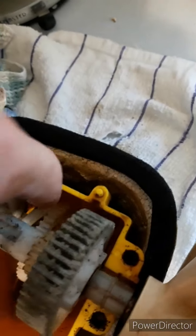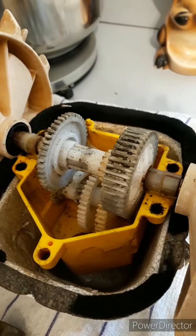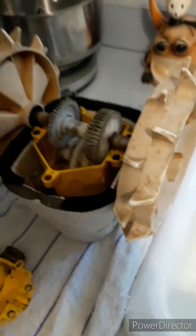Here are all your gears and how they go together. It's not a bad idea to take a picture of how that goes in there. This device under the wheels is like a derailleur on a bicycle - it changes gears. You have neutral, which is engaged now, low gear, and high gear. As long as these are in good shape, this whole unit is good. If these get stripped out and start missing teeth, you have to replace this, which isn't a big deal because Nelson is still in business.